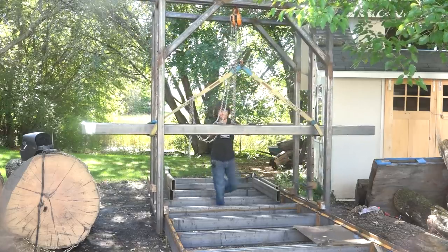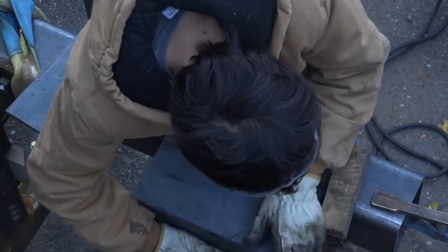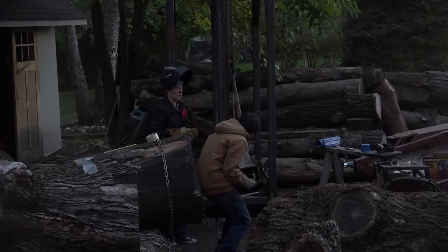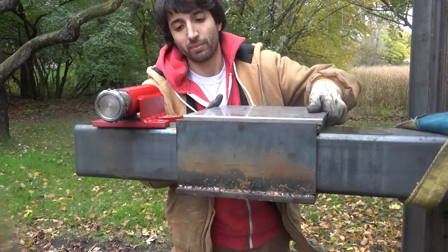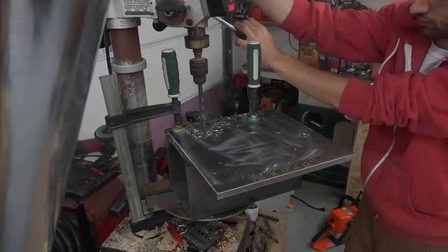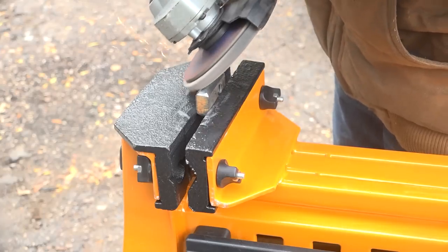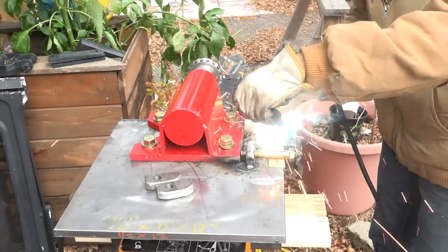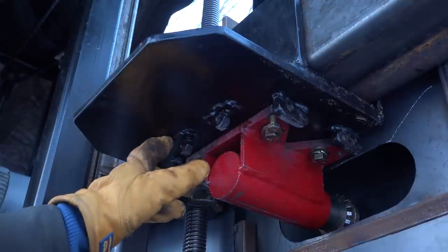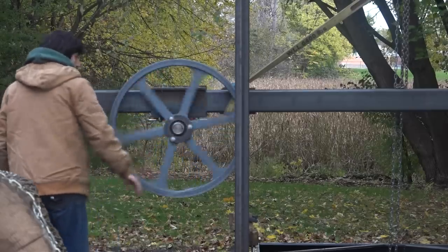That's going to do it for the carriage. Now we're adding the wheels, starting with the idle wheel. This wheel needs to be able to move in and out to tension the blade, so I'm creating a box that will slide over the saw beam. The beam is wrapped with a few index cards to create clearance, then wrapped with half-inch plate. I'll add a second plate to mount the shaft to, which also gives room for alignment adjustment screws. To make the adjusters, I tapped holes in half-inch bar stock, cut them to length, and added some shaping. A pair are added to each side to allow the shaft to rotate left to right, plus an adjuster to the back to set the in-and-out position. I also tapped holes for jack screws to allow for wheel tilt. The whole assembly slides onto the beam and the wheel can be mounted.